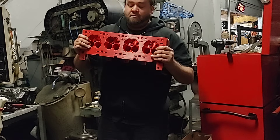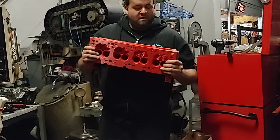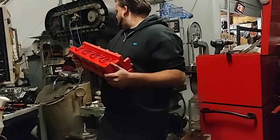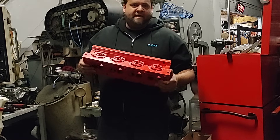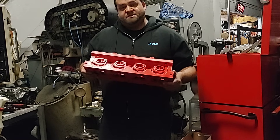These are fully water jacketed. I'm holding the plastic one even though it doesn't count and isn't real, because it's a lot lighter and far less expensive. I have the first four operations done, and there's about 40 hours of machine time into each of the cylinder heads.